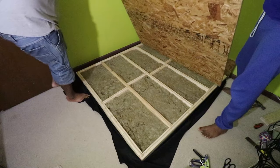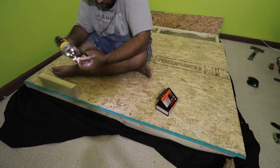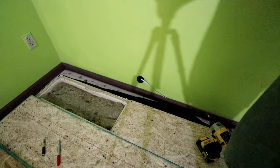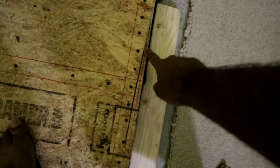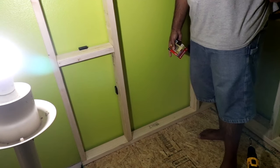I have my brother here and he did an excellent job helping me drop it down. Now you can see I'm screwing the drywall screws in on the borders, doing two inches, and in the middle the distance is more like four or five or six inches. I was kind of in emergency mode because there wasn't a long stud to support the OSB — if I stepped in between those two, I would have cracked the floor and fallen through. I was trying to cut off the excess OSB with the circle saw — no straight cuts — and when the saw was shooting sparks I realized I hit a screw.